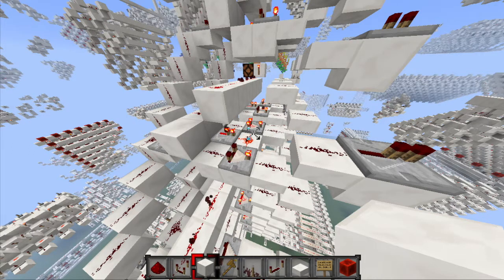As you can see on this design, we have used the space between every other layer to put in control wires, which gives us a completely functional design. This design also lets us rotate the data by shifting all of the bits that would be the overflow or underflow in the opposite direction.